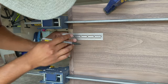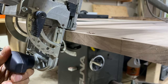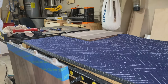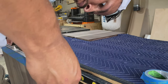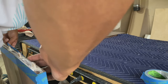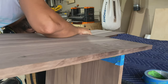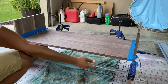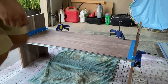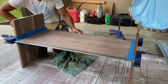I'm marking out for dominoes to connect my side panels. If you don't have a domino, you could use dowels, or just screws straight through the bottom — countersunk on the bottom where no one would see them. I did make the mistake of trying a tape trick to catch glue squeeze-out and make cleanup easier, but it totally backfired. The tape was hard to remove, got caught in the joint. I'm not a fan of the tape squeeze-out method.